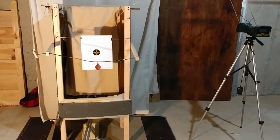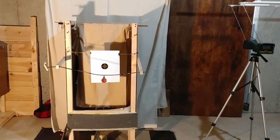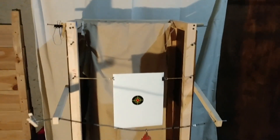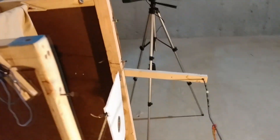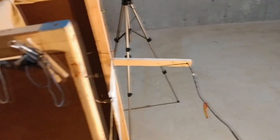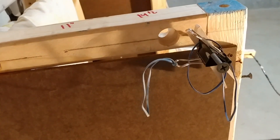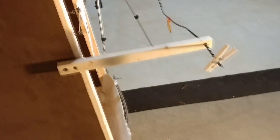As far as the box, it's 48 inches tall by 20 and a half inches wide and 14 and a half inches deep. The frame is made out of a 2x4 that was cut in half. You can see the dimensions here - these pieces are cut at 11 and these are cut at 17 and a half inches, and then the sides are basically 14 and a half inches.